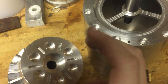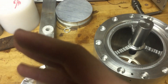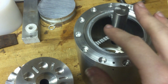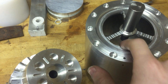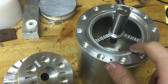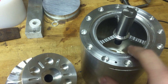That's important because it's a little tricky to build a motor and put the whole motor in a vacuum, because it'll probably overheat — it won't have any air to cool it down, it won't be able to convect heat away, so it'll rapidly overheat. So you want the motor on the outside so that it can be cooled. Either that or have a liquid-cooled motor, which I don't want to deal with. So you want a magnetic coupling so that you can drive it — it's in the vacuum, and you can drive it from outside in the atmosphere. But you have magnets next to what would have been just a solid sheet of aluminum — that's pretty much the definition of an eddy current brake.